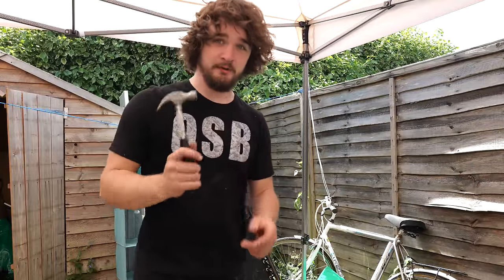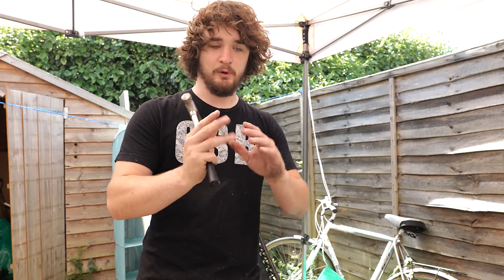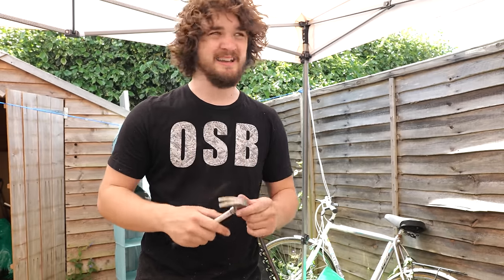They are gone. So like I said, the best hammer for it is a ball peen hammer with that rounded end on it, because it helps spread out the impact area whilst not leaving dents that are too prominent or too difficult to remove afterwards. It's ideal for this, and it does work on a variety of timbers, but I find that oak works really well because it holds its structure without cracking while being mushroomed over, whereas other, especially harder, timbers are too brittle, and as soon as you start whacking them, they end up splitting and it doesn't look too good.